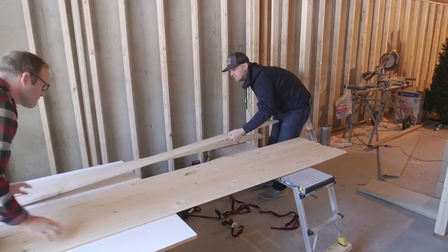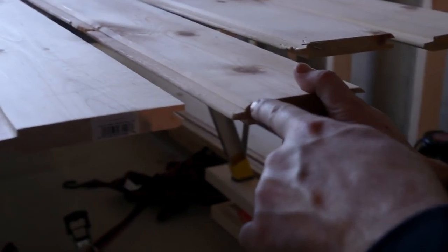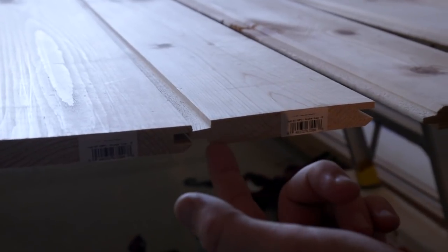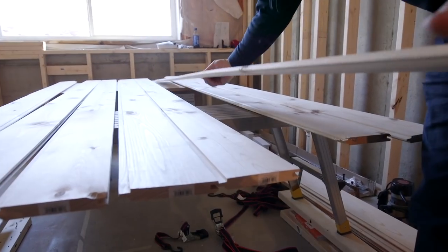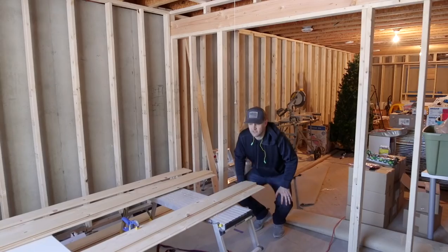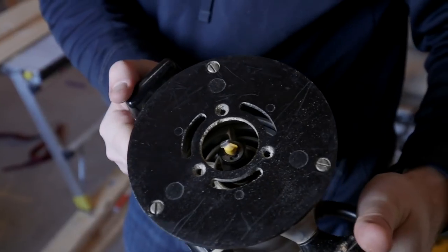For board selection, I want a really knotty and consistent look on the door. There's a front and a back too — this one I have upside down compared to the orientation of the others. You can see it's somewhat rounded on one edge while the others are flat. We want to rotate the boards so they're all facing the same way, with edges either all flat or all curved. To make the front of the barn door look the same as the back, we're simply going to take a router and taper off the other edge.